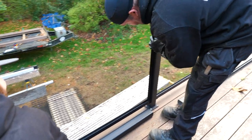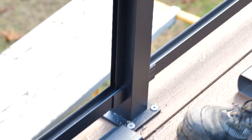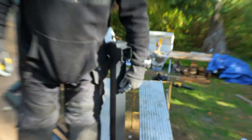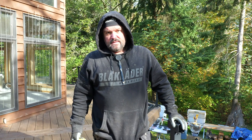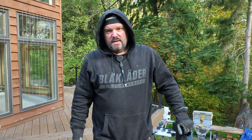You've got to be careful with these — there's a little bit of slop, but you could drop it all the way down and still be okay. You don't have to be super tight; if you make them super tight I'm concerned about getting them in. We have all our Regal Ideas rail posts installed, top and bottom rails cut, and the bottom rails are sitting in the base — not screwed in yet. Now Nazee is going to mount the U-channel, which is made for the Wild Hog hog wire, to the sides of all the posts. We also just figured out our fascia detail for the bottom of the staircase — that took a minute but it's looking really good. Now we can finish installing our deck boards, trim, and kickers, and then figure out the stair rail posts. We might also jump onto cutting some hog wire panels to show the overall look of the rail.